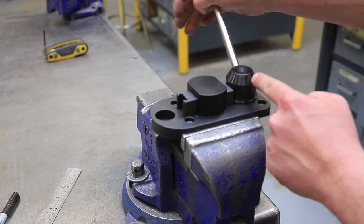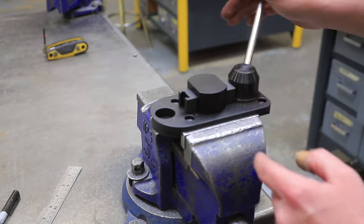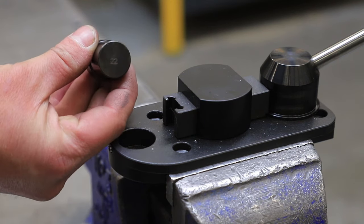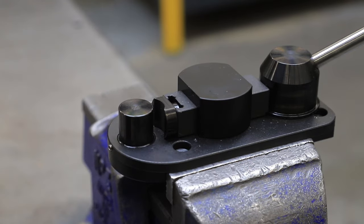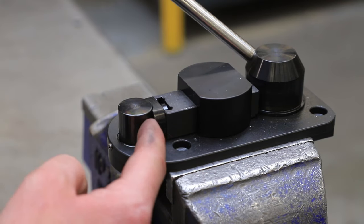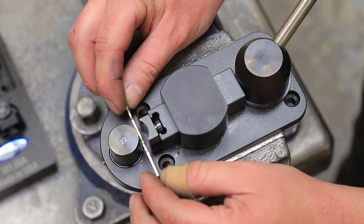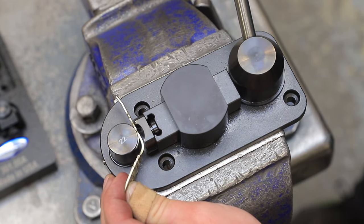The way this works it's kind of like a cam — this part moves up and down and forces the piece to go back and forth. My size 12 and a half finger translates to 21.9 millimeters, so I think 22 will be close enough. That mounts into the front and has a matching part that goes with it. So when you stick a piece of metal in there — ideally not your finger — it bends it around. I can go ahead and put my spoon in there. I may end up having to trim a little bit off, so I'm gonna start by bending roughly in the middle — hold it in there straight, press, turn a little bit.